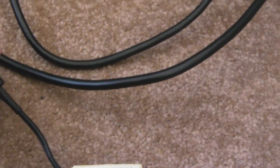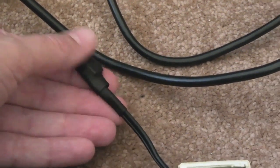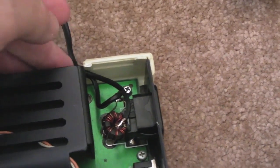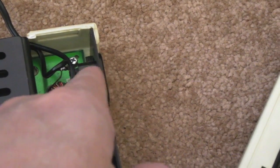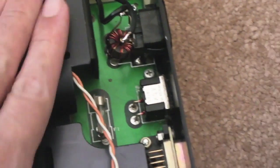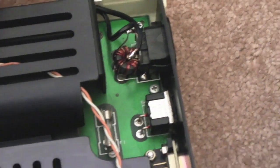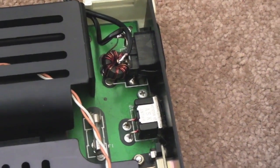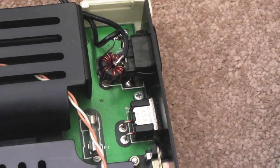As I described, I've added a power connector — it's an inline connector, not quite the right type, but it's heat-shrunk and totally isolated, coming out the back. With a full-width cart it can be a bit of a challenge getting it in, but it does fit — just a bit tight. I did think about swapping this out for a DIN socket, like a Commodore 64 type, so it could work off a standard C64 power supply, but I'd rather leave it stock so it can be reverted. You can easily just desolder those two connections and use the original power supply. The 12 volt DC supply works because there's a bridge rectifier on the board — polarity doesn't matter since it'll invert the supply either way.